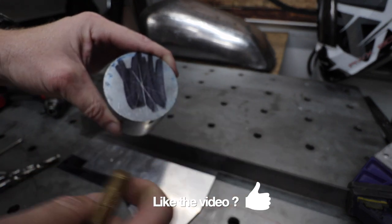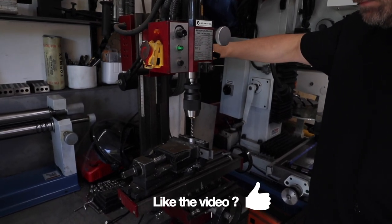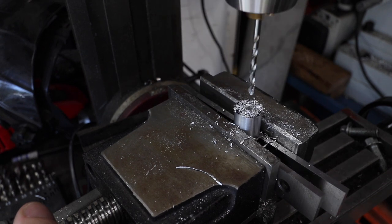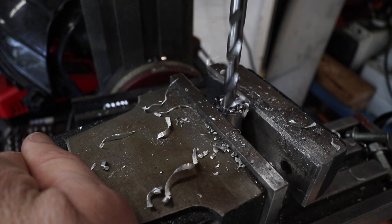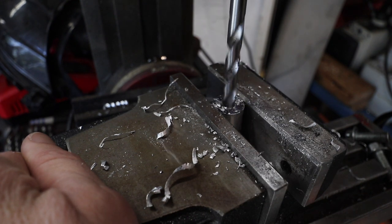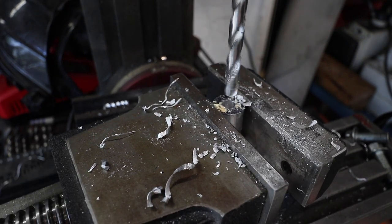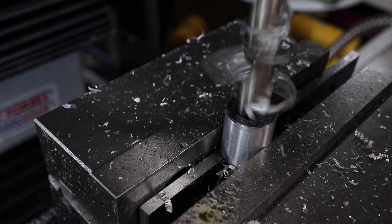Use a center punch to get that perfect dot in the center, then do a small pilot hole. Just in case you drill off-center, you may want to get a slightly larger diameter than you actually need so you can fix it later. I'm using aluminium just as a demonstration, but you'll probably want to use mild steel or stainless. Once you've found your center, drill your pilot hole, then your main hole all the way through for the shank of the bolt, then use the largest drill bit — but don't go too deep, just deep enough for the head of the bolt.